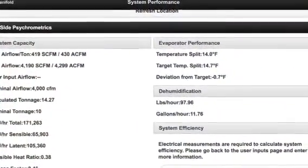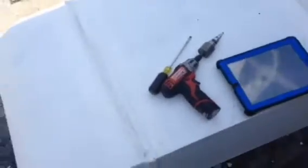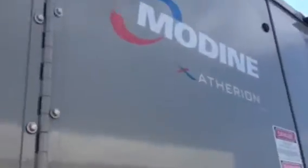I got my supply temperature and humidity probe in the supply duct here. I have inputted the user inputs — I got a 10-ton machine here. We are moving 4,381 CFM. A little high, but I got the VFD ramped up to 60 hertz because I want to create some positive pressure on this building to push some of that humidity out of there. This is what you can do with the iConnect on a rooftop unit — air flow is just that easy as taking a delta T. Very, very easy.